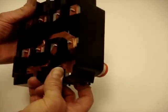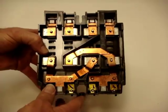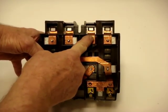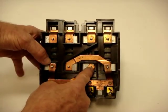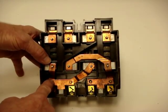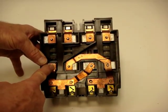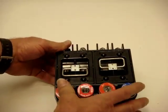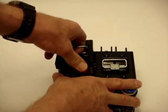This feeder tap comes off of this same fuse. For the other side — the right main fuse — power comes in from the top, goes through the fuse, comes out, feeds the two fuses on the right-hand side, the feeder tap on the bottom, and the far right range fuse. By the way, the fuse blocks on this particular brand are not interchangeable — the range will not fit in the main.